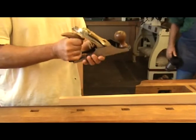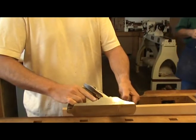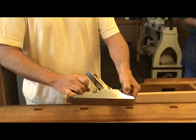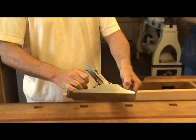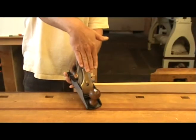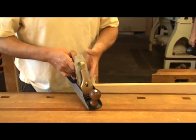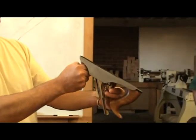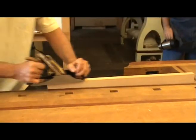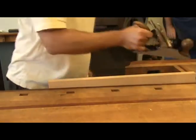The first thing you need to do is set the cutting depth. I recommend doing this on scrap wood and not your $500 set of guitar wood. Start by adjusting the depth adjuster screw counter-clockwise or clockwise to retract or extend the blade until it is flush with the plane sole. A light pass with your finger will tell you if it is sticking out farther on the left or right of the sole. Use the lateral adjuster to square the iron with the sole. You can also turn the plane over and sight down the sole to make the lateral adjustment. Make a light pass on a piece of wood, making small depth adjustments until the iron begins to make contact with the wood.